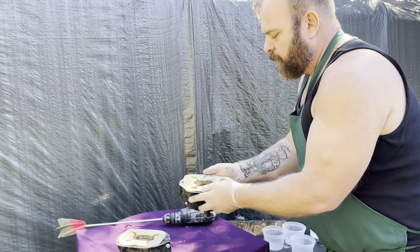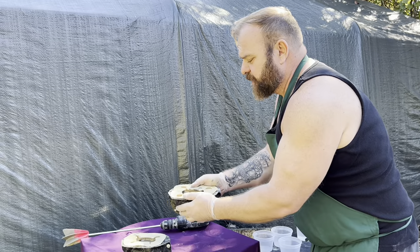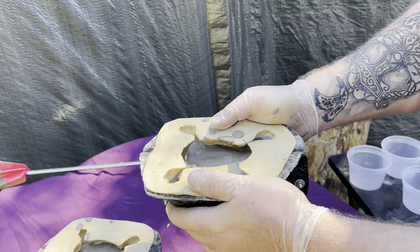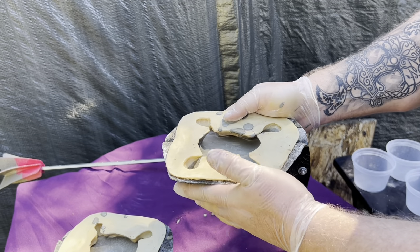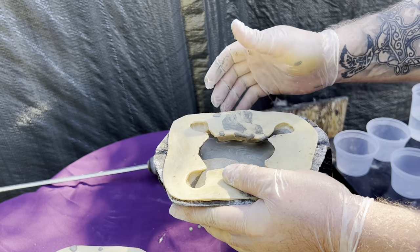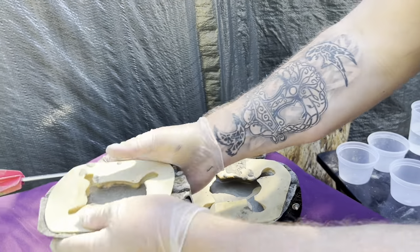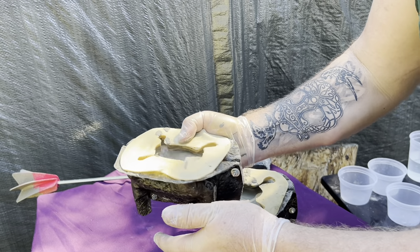What I do now is take the mold and just kind of shimmy it back and forth — just a little back and forth so that the cement in it is shifting, kind of like you're sauteing vegetables in a frying pan. Just back and forth — that will get the air bubbles out better than anything. Some people take a mallet and hit the mold with it, but I find just shifting it back and forth, even twisting it, seems to work the best. I'll do that with both of these — just a quick little shift back and forth.